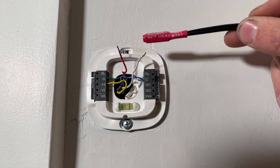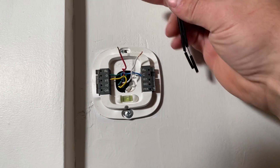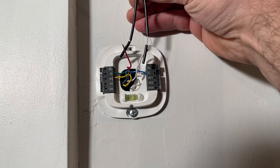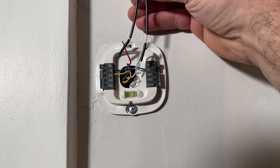That's what this does — it will keep the house at 65 degrees. Literally all we're going to do is take one of these wires, hook it here, and the other here. The polarity does not matter.